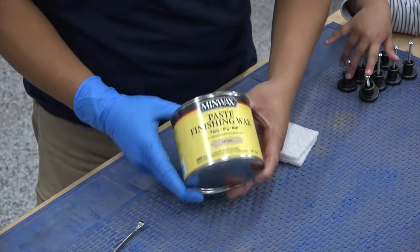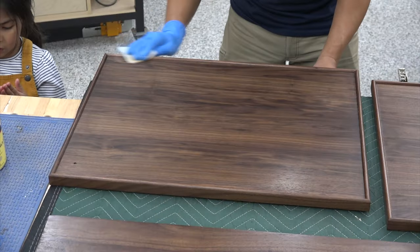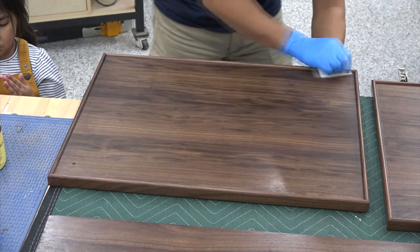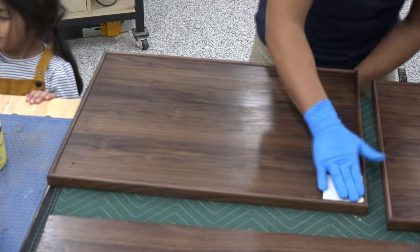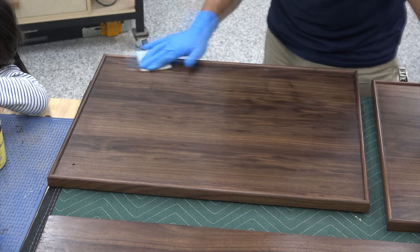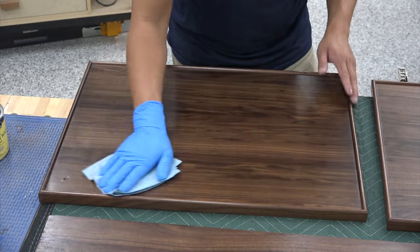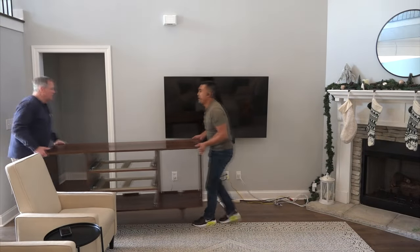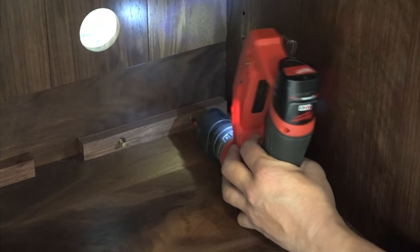The final step to a great finish is to buff out and polish the film finish using Minwax Furniture Paste Wax applied with synthetic steel wool. A hand-rub finish allows you to quickly remove the last dust nibs on the surface, leaves a much more uniform sheen, and makes the piece feel ultra smooth. Simply charge your synthetic steel wool with a bit of furniture wax — the wax acts as a lubricant for the rubbing process. I use long strokes and good pressure, then wipe away all remaining wax with shop towels. On installation day, once the cabinet back is placed against the cleats I use one inch screws to attach the back, then attach the doors to the mounting brackets and clip the drawers into place.